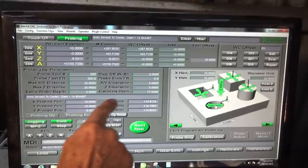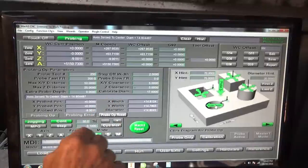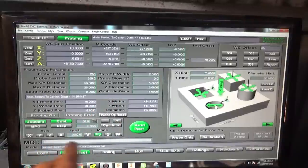It's also configurable, so you can calibrate the probe to take into account any overrun on the position of the switches inside the probe. I've already done that, and I don't mess with it now, and it's pretty accurate. I actually like it.